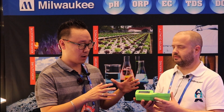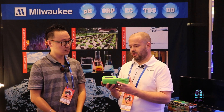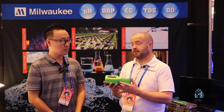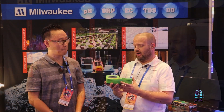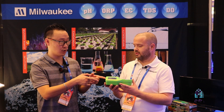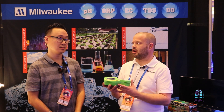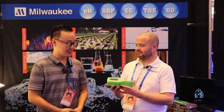For accuracy, what is the margin of error on this unit? When you're measuring specific gravity with this unit, the margin of error is plus or minus 0.002. And how long does a battery on something like this last? If you leave it on continuously, generally a nine-volt will last you about 70 hours. But this unit has an auto turn-off — I believe it's after two minutes of non-use it'll automatically shut off, so it will last much more than 70 hours.